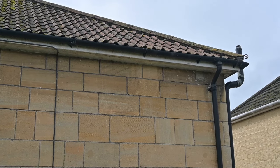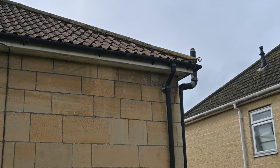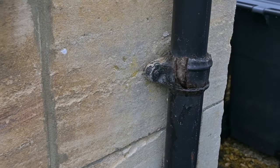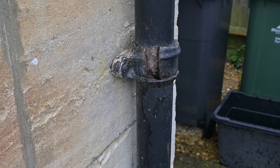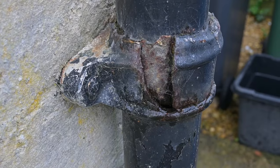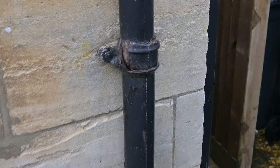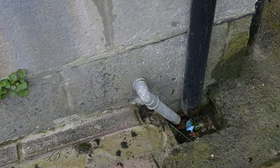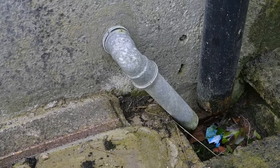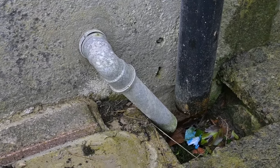We've now got a mixture of modern plastic and old cast-iron rainwater pipes. The gutters to the front are cast-iron; those ones are plastic but they're still discharging into a cast-iron downpipe. Rusting involves an expansion process which can break up the pipes, and this rear downpipe very obligingly has a couple of fractures and a chunk of cast-iron missing — that tends to be the fate of cast-iron gutters and downpipes. There's also a plastic waste pipe from the utility room; these become brittle and break up when exposed to sunlight, so the cast-iron has done rather well by comparison.